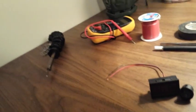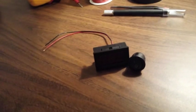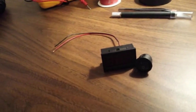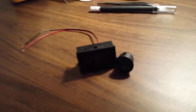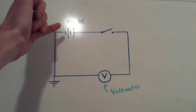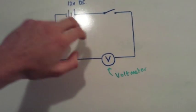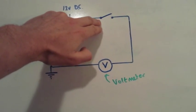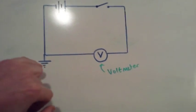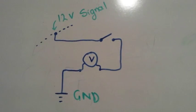Basically it's super straightforward. I've seen so many videos on YouTube that just make it seem so complicated, so I thought I'd just record it. This is the circuit you're going to make: you've got 12 volts coming from your battery, and you're going to run that wire through a switch into your voltmeter and then down to ground. In practice, it's going to look like this.